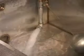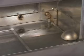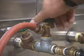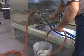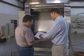Under very dry conditions, when moisture demands for cotton are high, the unit will need a water supply that can deliver 5 gallons of water within 60 seconds. To test the water volume available, place a 5-gallon pail near the convenience faucet and time the period it takes to fill it up from a short hose. An insufficient water supply can create temperature instability and excessive scale formation.